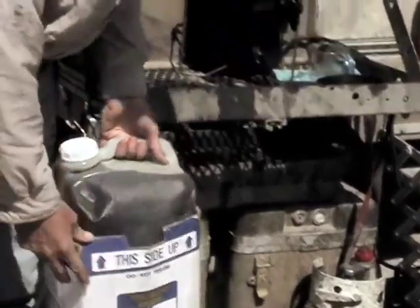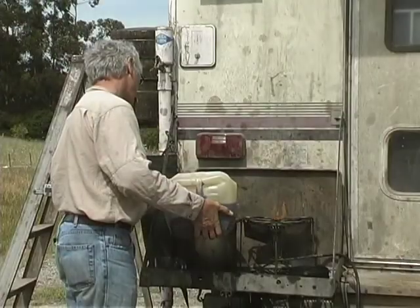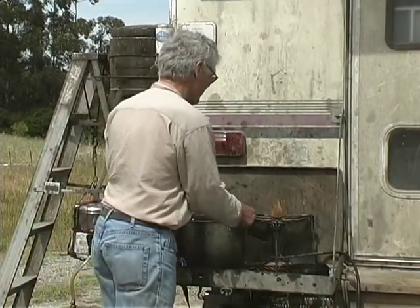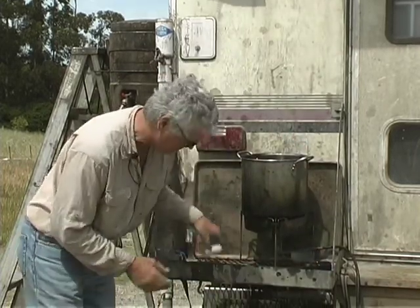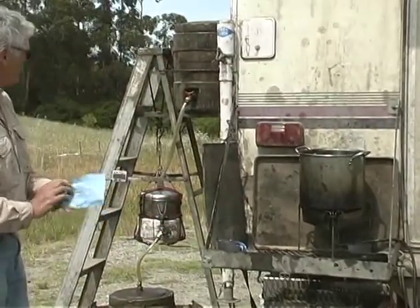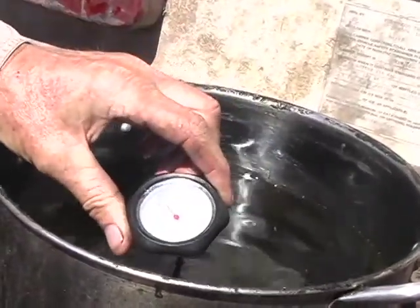You can see how dark the oil is. I put it in this three-gallon pot. This is the first official demonstration we've done. We didn't start this trip out thinking we would be ambassadors for straight vegetable oil as a fuel, and perhaps we would have a little cleaner setup. I heat the oil to about 170 degrees.